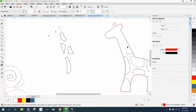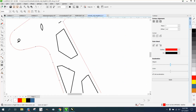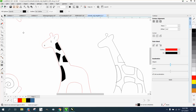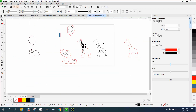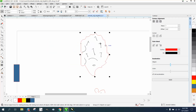Instead of having that black line on the outside, we can just nudge the contour over. So now you're going to have a black line that is well inside that contour line, so it's going to be definitely on the pieces. I personally think you could fill these in and add a little detail. Because if you're going to engrave this, it's not going to take any longer to engrave it like this than just the line — the laser is still going to have to go across there and engrave those lines. This would be a great example to vector engrave these lines because it would work a little faster.